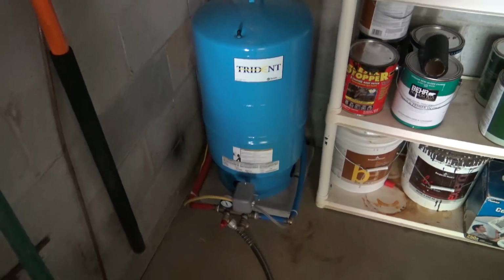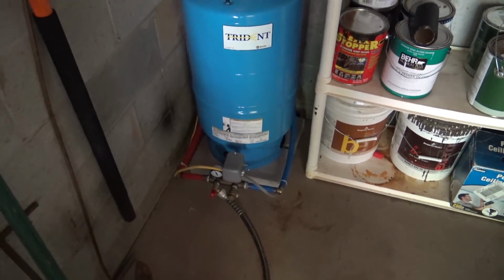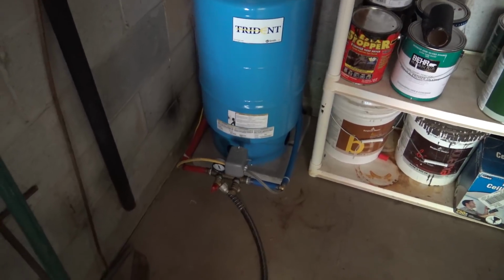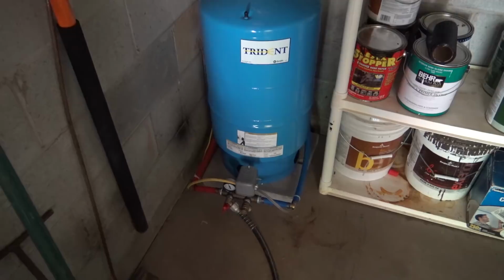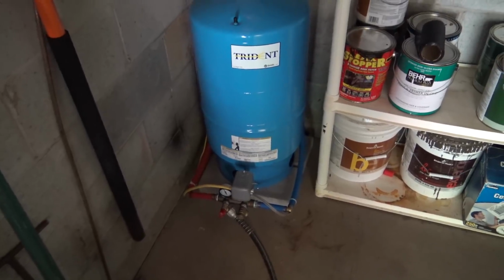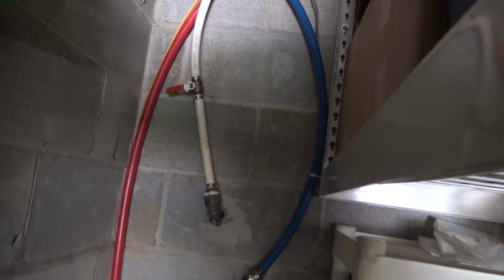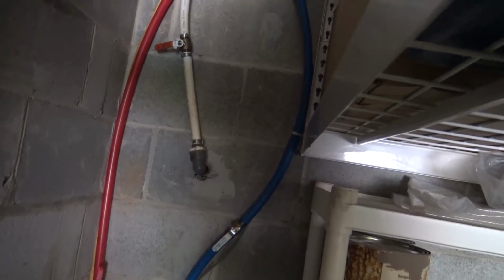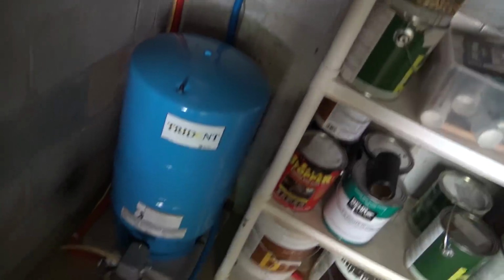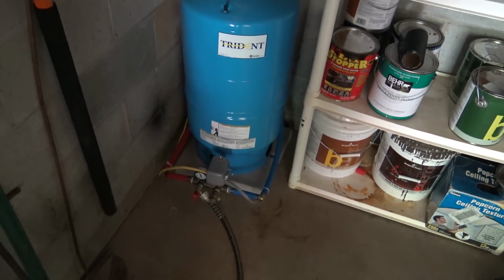I clamped the power usage of the pump that we put in the spring, and it maxed out at 4.1 amps. So very, very forgiving to the inverter, and it's going to be a great system. We ended up plumbing it in with the city. Well, they have city water, and now they're hooked to the spring. So it's just a case of understanding which valves to turn when. And so what we usually do is a commissioning video that I give the customer.